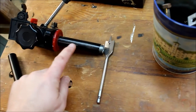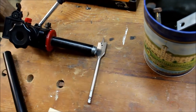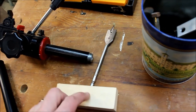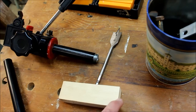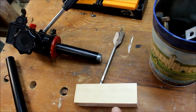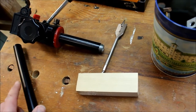I have to make something to be able to clamp onto this part right here. So I'm thinking I'm just going to drill a hole in here — I already measured it, it's about seven-eighths inches, and this tubing is about seven-eighths inches. I'll drill a hole in there, cut a kerf in it, and make this a clamping system with maybe an adjustable screw that I can clamp tight around here.